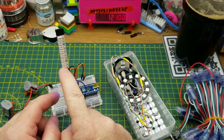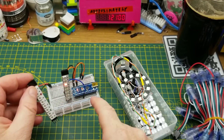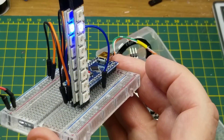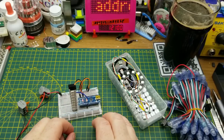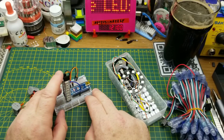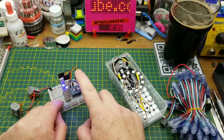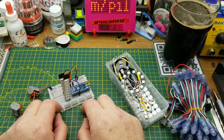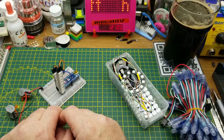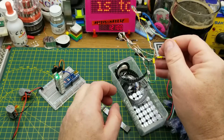That led me to dig out my box of WS2812 LEDs. Normally the data out from one goes to the data in of the next. But can I run them in parallel, so that the first LED on this string and the first LED on that string are both treated as the first LED? The answer seems to be yes, which is pretty cool — even though everything I've read online advises against it. The supposed reason is that the input impedance of these LEDs, if you put enough of them in parallel, will pull down the voltage on the control signal, or mess up the input capacitance. But it's pretty obvious that two LEDs won't cause that problem, so now I'm wondering how many I can run in parallel.